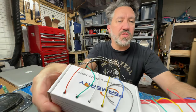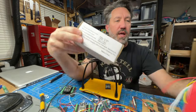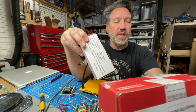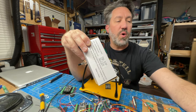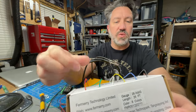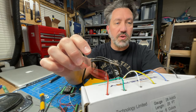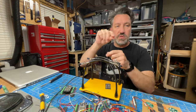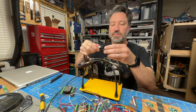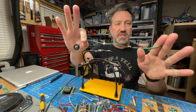We're going to move the LEDs first — they're on pin D23. Those boxes are hookup wire: I have 22 gauge, a relatively thicker wire, good for power distribution or areas where things get moved around. I also have 28 gauge — much thinner, good for tight spaces where you're repositioning things. Both are silicone-coated and very flexible, making wire management easier inside devices. First, I've disconnected my chain of LEDs.